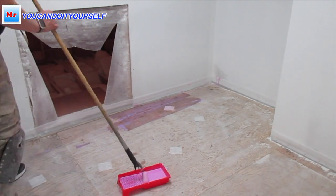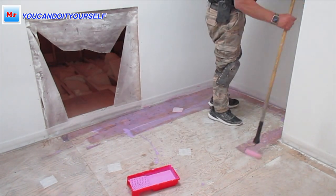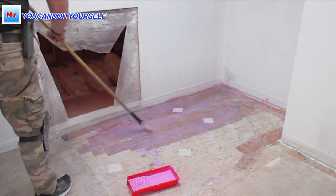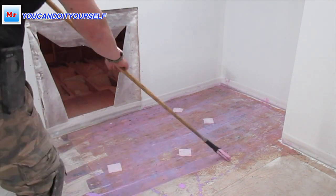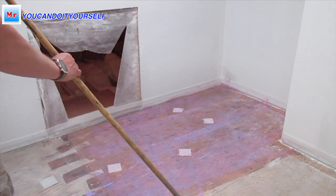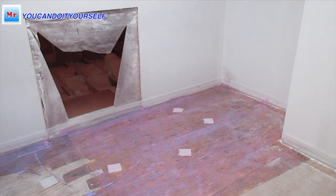And I put the foam and caulk on the bottom of the foam to avoid any leaking downstairs, because it's second floor. So then I apply primer, and you see the pads, white spots, squares. This is the foam I put with staples down, and then put the caulk around. There were some holes.